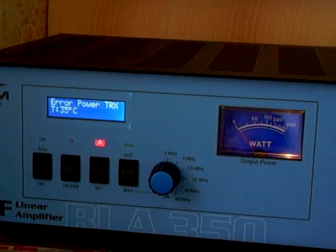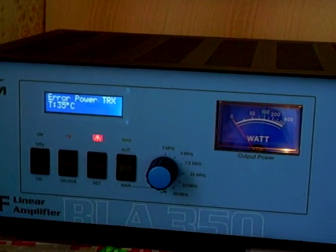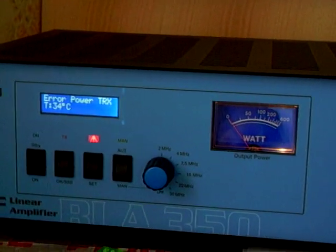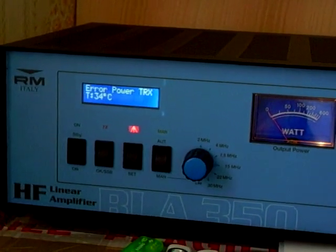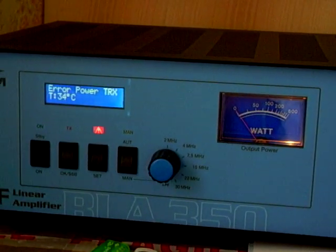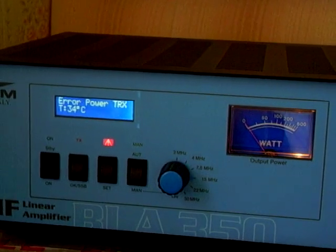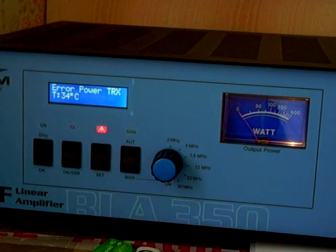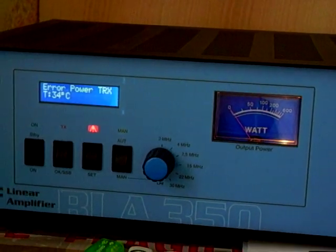As I say, you'll get about 300 watts — between 300 and 350 out of it. I hope that's informative. Make sure your antenna's already tuned. If you can do it without having an ATU or anything in line, and your SWR's flat all over whatever bands you're going to use, then you'll get the maximum power from the amplifier.